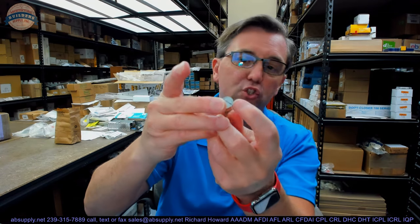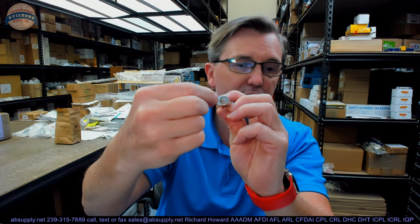Where are you going to use this? It is a little bit large for small kitchen cabinet work. There is probably too much spring tension on these ball bearings, which you can adjust by the slotted preparations in the end of the body here to allow that ball to go back with less compression of the spring inside. So you can tailor the amount of force it will take to open and close the door. But larger doors is really where you will see this — things that are not just 18 by 18 cabinet doors, probably larger material. You might have some cabinetry with a 2-foot by 4-foot door. Something a little heavier might be exactly what the application calls for in this EPCO adjustable tension ball catch.